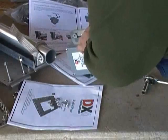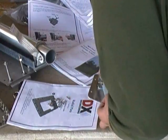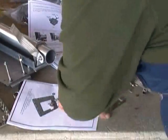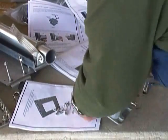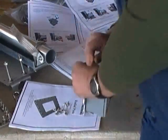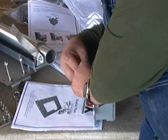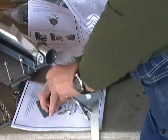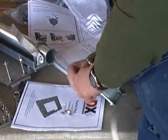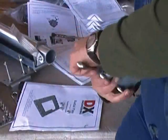I've got the bracket on. These are little tiny screws so they're real easy to mess around. Don't forget the washer — you want a washer on the plastic side, because if you don't use a washer when you tighten them down, the nut can pull through. That washer gives it extra area to grab hold of and gives it extra strength. This is a very well-designed and well-made antenna. It's very sturdy.